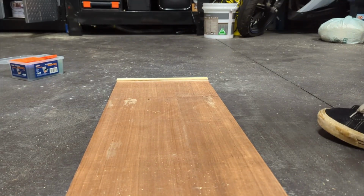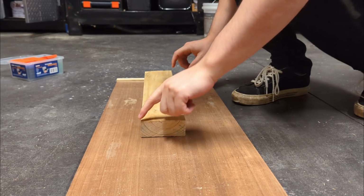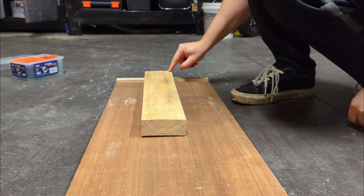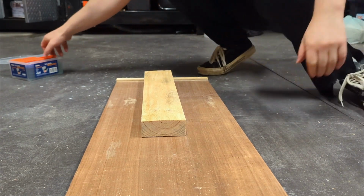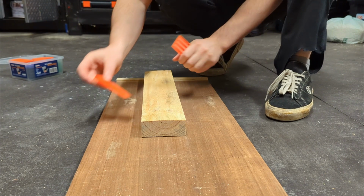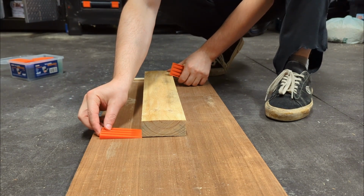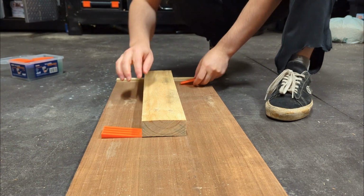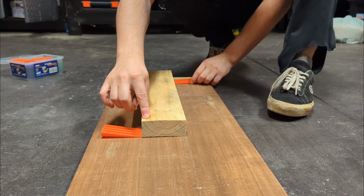Now we have the leg pieces rough cut to size, we need to flatten these warped boards. They're all cupped and twisted, so to fix that we can use the planer again, but this time using a simple sled to give us a straight reference edge for the thickness. We simply place each board on the sled, give it a bit of a rock to see how it moves,